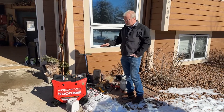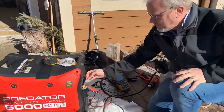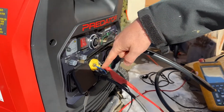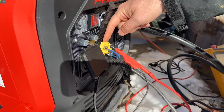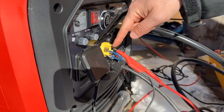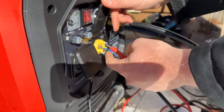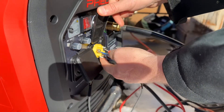Did a little bit of research on this — come on in close and take a look at what we did. This is a temporary setup right now, but what we're doing is bonding the neutral and the ground together, and that's what this plug is doing. These generators have what's called a floating neutral. So there was 60 volts here, 60 volts here, and ground was the zero reference. By bonding these two together, now I get 120 volts and then zero and zero.